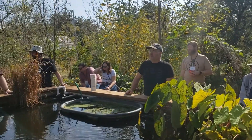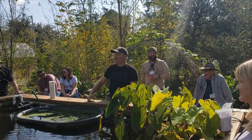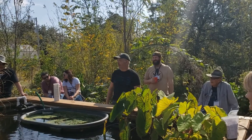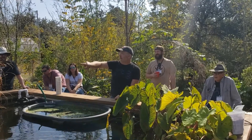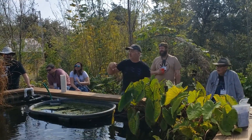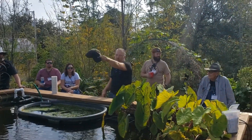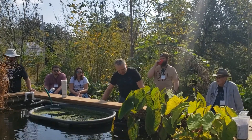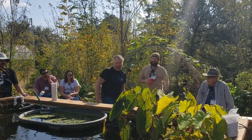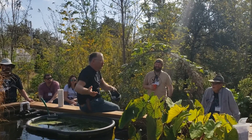That bed over there looks a little different — the last two timbers were installed crooked and they're spiked in with big galvanized spikes, so they're not coming back up. I found the high spot, packed a 2x4 up to it, leveled the 2x4s off, and the gap in the back I cut some 3/4-inch plywood, shoved it in, and finish-nailed it. This is going to be a teaching area — we're going to put in a little removable platform so when you're standing there you can see into the pond without being up to your waist in it.